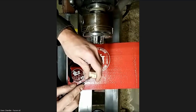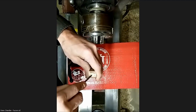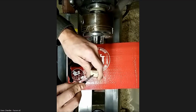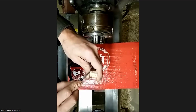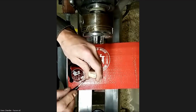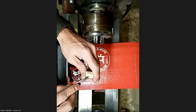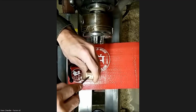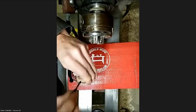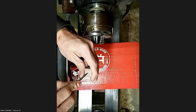Then you come in with your center marker, and all I do is I just come up through the center to the point where I know where that hypotenuse is. This is how we were talking about so much geometry. So we're talking about a squared plus b squared equals c squared, and that's as long as I'm going to talk about it. Then you come in and boom, now you've got your center. And then you do the same.